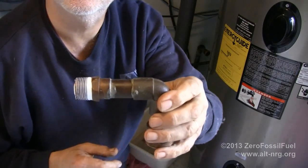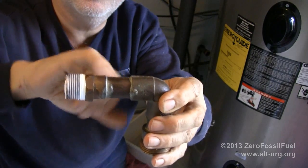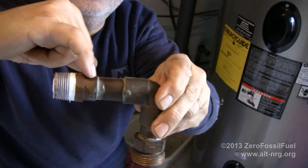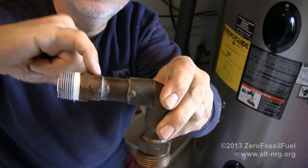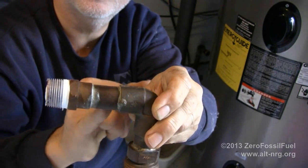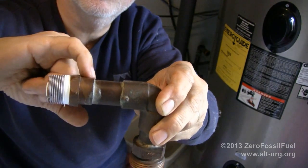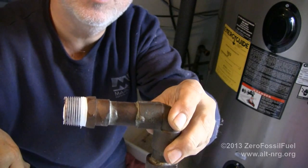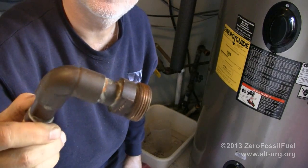Alright, so what I'm going to do next is I'm going to take this down to the shed. You'll see this little section of copper pipe actually extends probably all the way to here inside the elbow and into here inside the compression fitting. I'm going to, with the torch, remove probably from the elbow, pull the pipe out, cut 3/4 of an inch off so that when it's reassembled there will only be maybe 1/4 of an inch exposed pipe rather than an inch worth of exposed pipe, and that should allow me to align this compression fitting down below when I reassemble the new water filter.